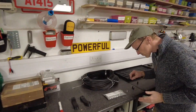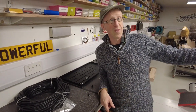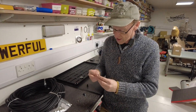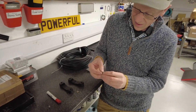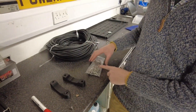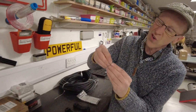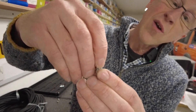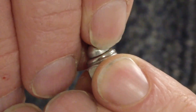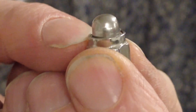We just got a delivery of dome stainless steel Nylock nuts for the fixings of the picnic table. And the first one I tried just fell apart on me — look. That's the first one I took out of the bag of a hundred. Zach printed the label — can't blame him. But it's quite interesting: this is a good one and you can see it's crimped to crimp the dome. But this one clearly skipped the pressing process — the side walls are parallel, it doesn't crimp over, and hence it just falls apart. The others seem okay.